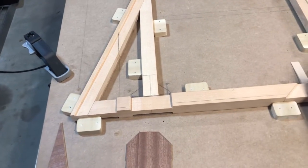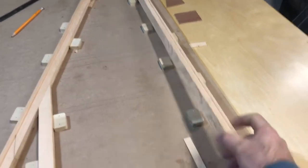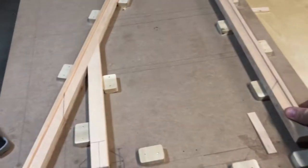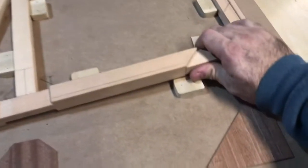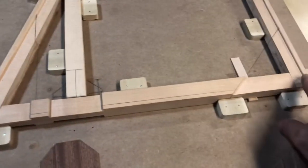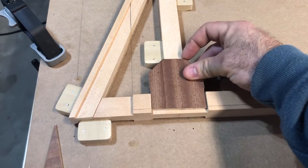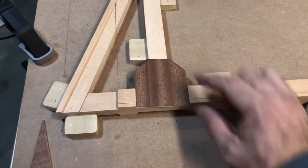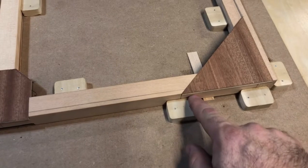A note about this piece — the base of the vertical stab. The plans call to make this piece similar to the leading edge and trailing edge, basically just making them a tee, cutting in some rabbets. I don't see any reason why that needs to be done. I've seen some builders where they rabbit out the whole bottom piece and then put the gusset down to the rabbit lip — that's not proper per the plans. The gusset is supposed to go flush to the base, the way they draw it.